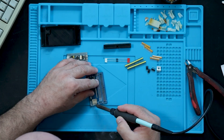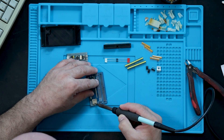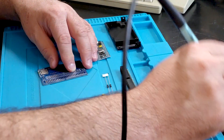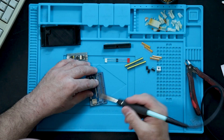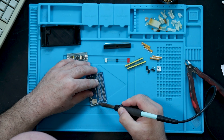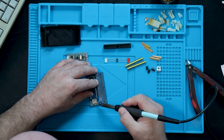To connect the contact pins, add some solder to the tip of your iron, then gently apply it to them, making sure that both the pin and the pad are being heated. It's not a problem if you get a bit of solder bridging between pins — we'll take care of that next. Once all the contacts are soldered down, you can remove any excess solder by cleaning your iron and carefully drawing the excess away with the tip of the iron. The clean iron tip will absorb the excess solder. Repeat the clean-and-drag process until all excess solder is removed.